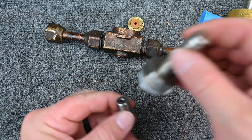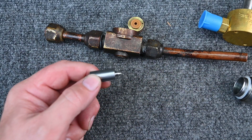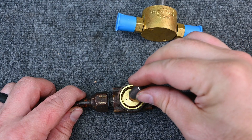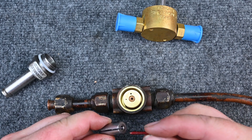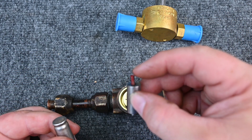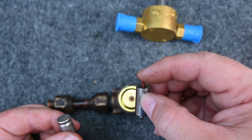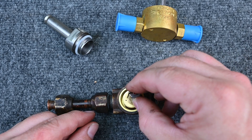All this pin does is move up and down. It has a little needle on the end. Here we can see the needle is pushing right here on the valve, with a spring that fits on the end and keeps it pushed up against the top. These springs are sensitive to temperature — if we get too much heat from brazing, it'll damage the spring.